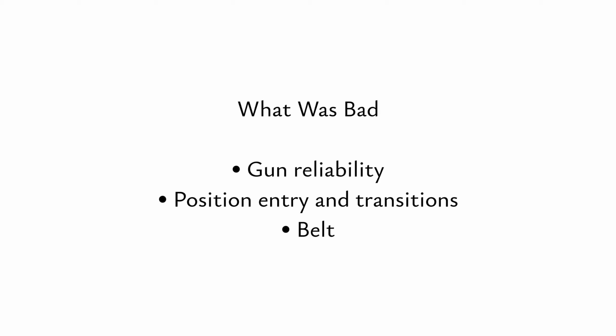The second problem, the action stiffness, has at least two causes. Cause one, the geometry of the hammer dog and the double action components on a Ruger trigger are apparently pretty important, and also not fully interchangeable. I was running a bobbed hammer in this video, you might have noticed, with an eye toward eventually bringing the trigger pull down further by clipping some coils off of a trigger spring. When I swapped the hammer dogs between my stock hammer and the bobbed one, neither hammer works, so clearly there's more to the geometry there than I've considered in the past. The short version of this fix is that I went back to the stock hammer for now, and I will put up with what I've got.